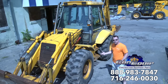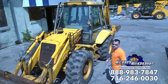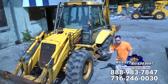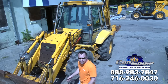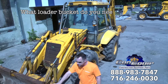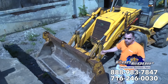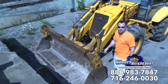It depends on what you're looking for. If you got a landscape yard and you're just going to use the backhoe for loading mulch and a couple odds and ends, two-wheel drive might be okay for you. That'll save you a few thousand dollars in initial cost up front, but also thousands of dollars down the road when you have to buy a rebuilt front axle assembly. Four-wheel drive versus two-wheel drive. The next thing would be the bucket up front. Some machines come - like this one has a four-in-one bucket, combination bucket. You might not need it for your application, but these buckets are expensive and they also have hydraulic cylinders on them. A bucket alone would probably be about $1,200 good used.